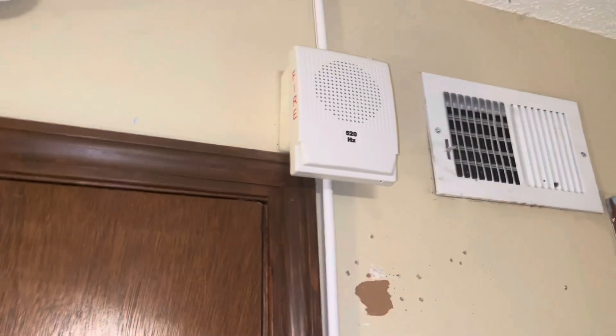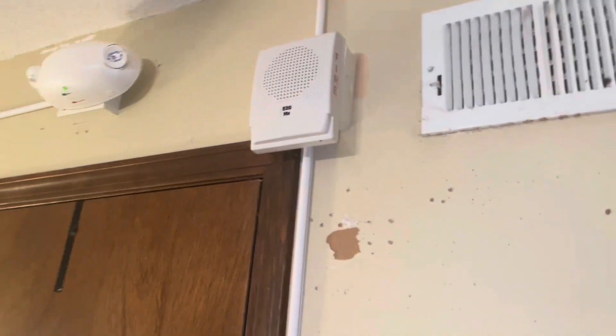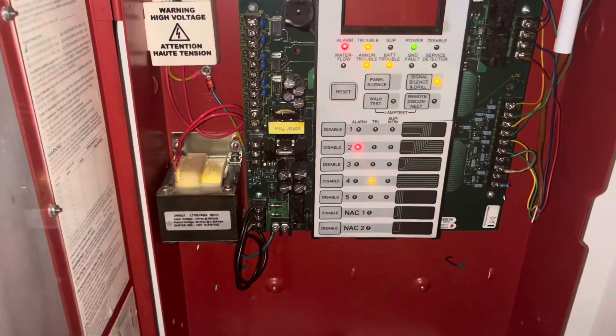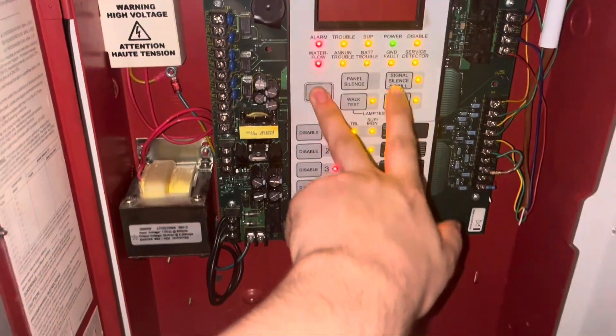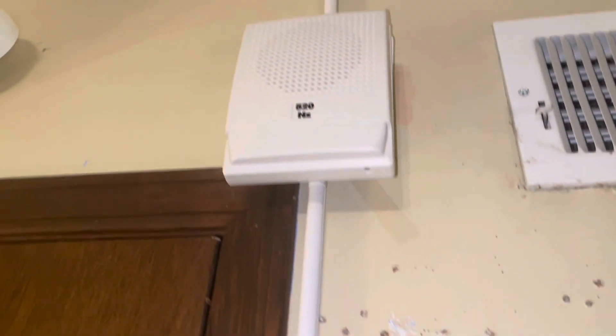You can go out here and check this out — this low-frequency horn isn't doing anything visible since it's a low-frequency horn. If it had a strobe on it, it would be flashing because it's a Genesis alarm. We'll go ahead and reset. One thing that's interesting about this low-frequency sounder is that whenever it loses power, it pops — it is a speaker, so it makes sense.